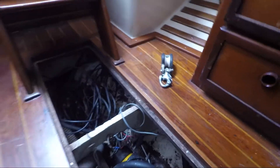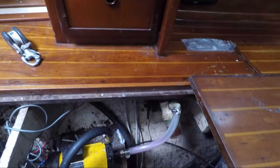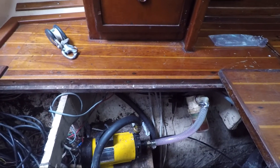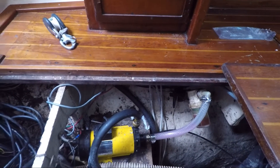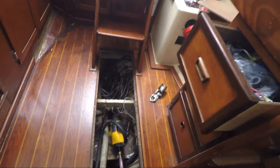For the air conditioning — the HVAC — the HVAC pump is right there, the sea strainer for it — all that's been turned off. Antifreeze has been pumped through the HVAC system and it exits out right there. The drain is clear and we've got antifreeze down at the compressor, at the air conditioner. So that was it for that.